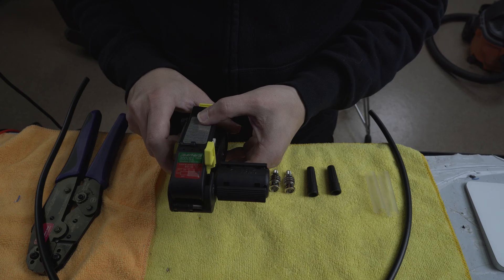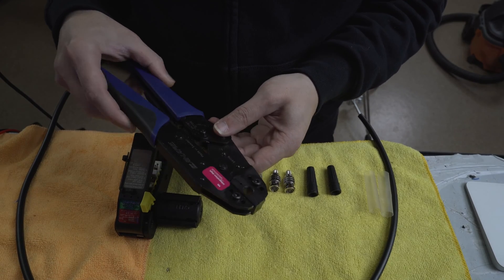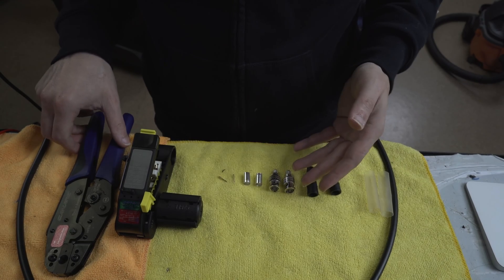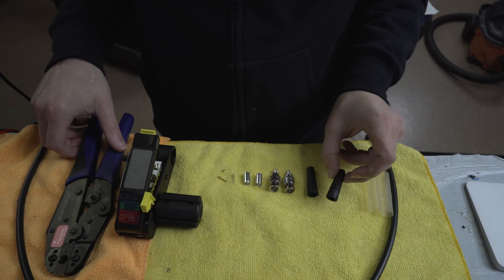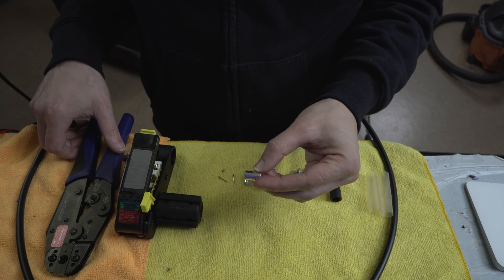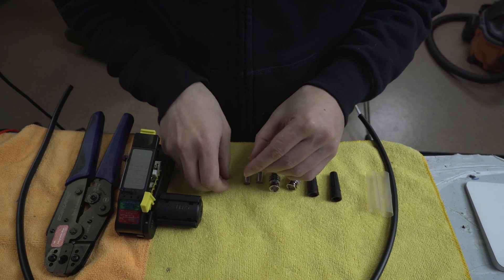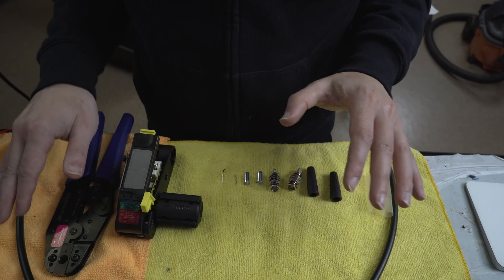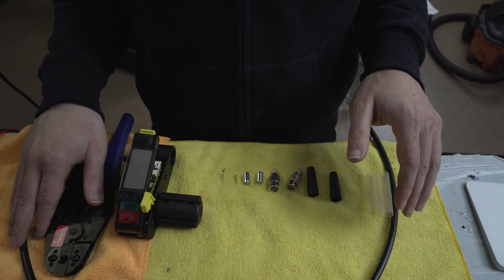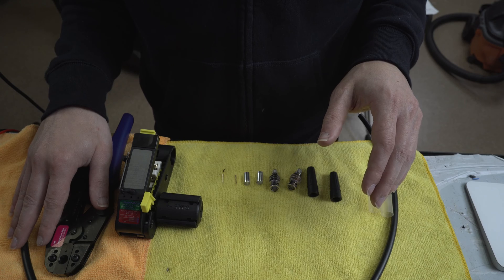You need a cable stripping tool, which is this — this is the TS-100E. You need a crimp set that also includes a die for the connector, and then you need the physical connector itself. I like to run these little back boots on there, there's the connector that interfaces with the jack, there's the little compression ferrule that goes on the back, and then there's the little needle that goes on the coax. We are using a 12G rated SDI cable, it's a 75-ohm cable, it is called the L5.5C UHD cable.